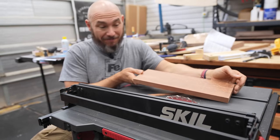At 90 degrees this will cut through a full-size four by four — in other words, three and a half by three and a half. It's actually about three and five-eighths inches from the throat plate to the top of the blade, so you shouldn't have any worries about cutting capacity. I like that the fence has a high/low feature — in other words, it flips over — and you also have the work support when you're ripping wide panels. Personally, I think this is one of the best bang-for-the-buck table saws a beginner or someone on a budget could buy, because it just has all those features in a nice package.